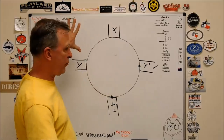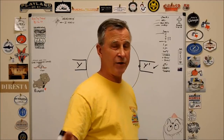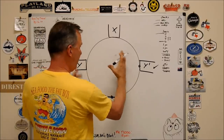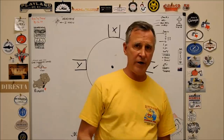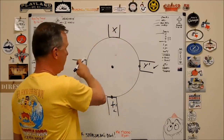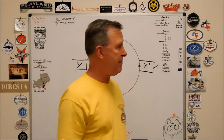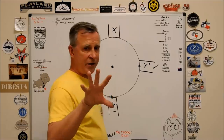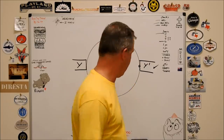As this diameter increases or decreases based on the cart of parts you got from the first shift guy that used up the tolerances because he wasn't paying attention, this radius falls away from center. It'll fall this way or it'll migrate this way. So whatever you're doing to this, if you're boring holes in it, if you're turning a journal on it, it's going to be eccentric to the OD as the OD changes with this four jaw method when you only use two jaws. If you're going to check it or indicate it each time, it's fine. You've got nothing to worry about. But a three jaw or a six jaw chuck, because it comes in concentric, it will maintain the center line of different diameter parts. This is a fact.